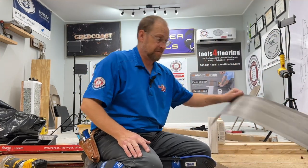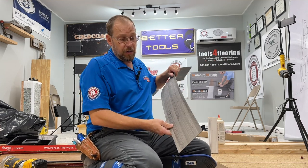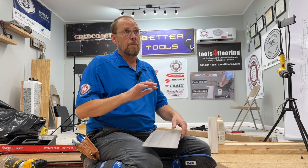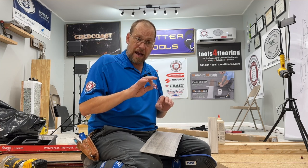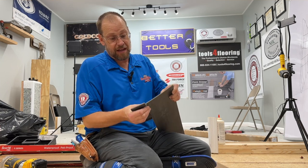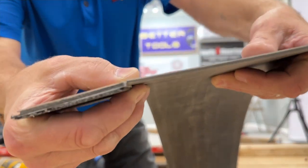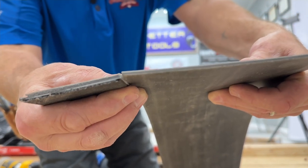The carpet store always has plenty of plank around. So whenever I make my transitions, I will use this glue down vinyl plank because it's thinner than the click together vinyl plank that was actually installed. I started using this on the top of my transitions because I only use it on the top, since it's what overlaps and gives me an overlap transition. It's about half as thick as the commercial grade vinyl plank here. Let me just let you see real good there. So this click together is about twice as thick as the commercial grade glue down.